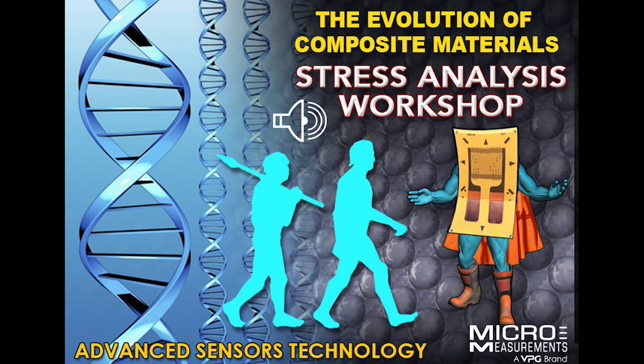Day five in the morning, we're going to check it out using Bruno's test equipment — the 2,000-pound test frame. We like to pull these to failure. Bruno's also got another example set up in accordance with ASTM D695, a compression test, which he'll run for us. We're also going to spend a few minutes on photo stress, and then we've got hands-on exercises that typically work their way through the morning and into the afternoon.